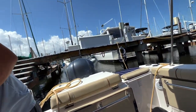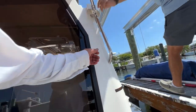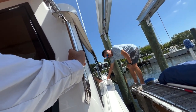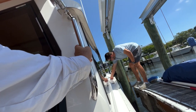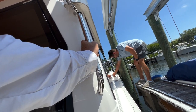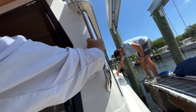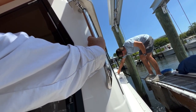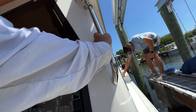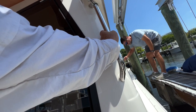I believe everything is on one side. If you stay here, I will show you. You can peek around the side. Let's say you wanted to pump out the waste or fill the water. There are no deck keys. You just push in the middle and the tab lifts up, and then you can loosen it up and pull it out. The water one has a chain. The waste one does not have a chain, so you can completely take it off to put the suction piece on top of it. Take this off, and make sure that you hold it.